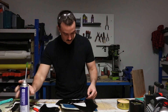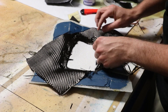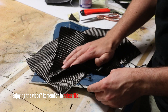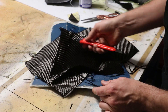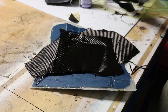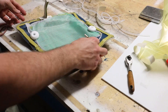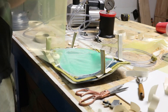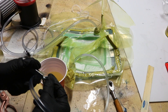Another thing I thought might help was adding some strips of carbon fiber between the outside of the soric and the corner of the mold. And I've got the whole mold ready for infusion again. This time when adding pleats I made them a lot bigger, adding four of them, just to really help the vacuum bag sink all the way into the mold and push the carbon fiber up against the mold wall.